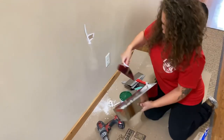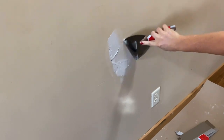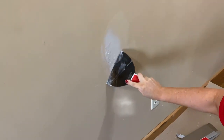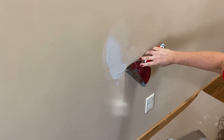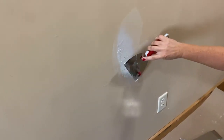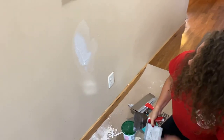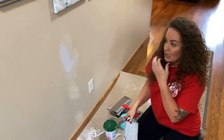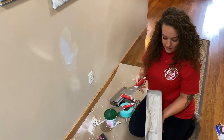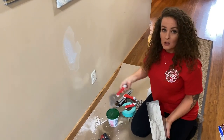I have a 6-inch knife and I'm going to go ahead and pack it into that patch, getting rid of any loose stuff. Now we're going to let it set. If you have multiple patches around your house, what's really smart is to cut them all out and then hit all of them at the same time with this mud. Mix up your mud, go hit all your patches, come back, and they'll be dry in time for the next step.